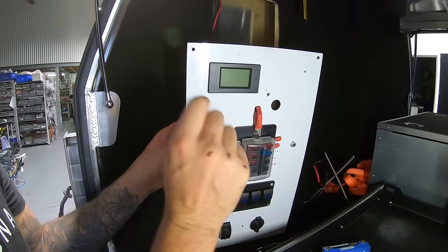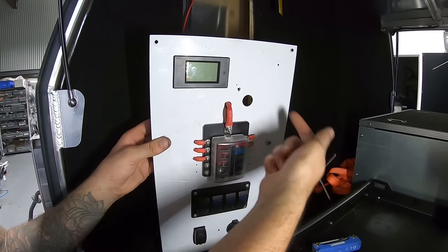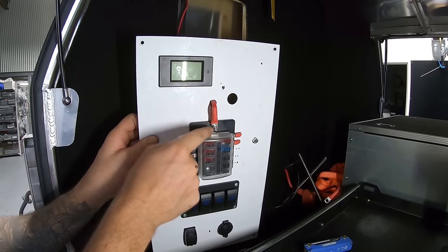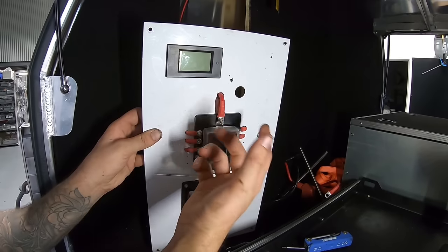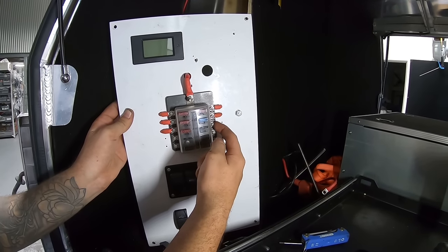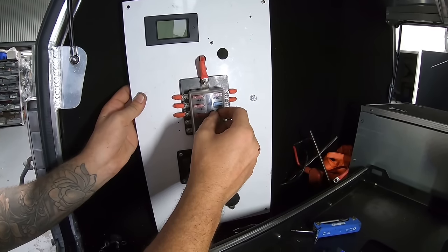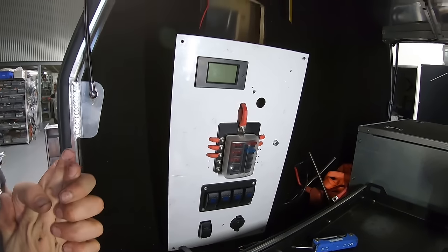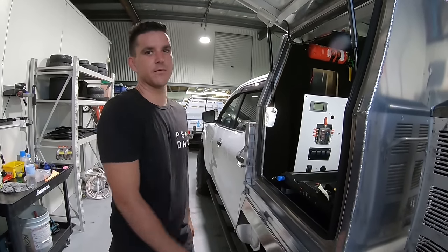How I had it wired before: the solar output came to the positive wire going straight from the battery — the wire that sits on the positive terminal went straight to the top of the controller. So it's technically going back to the battery, but nothing there was fused. On the new setup I'm going to put the solar output onto a fuse block and put a 15-amp fuse in. That way if anything shorts out and exceeds 15 amps, it's going to pop there instead of frying the whole system or catching on fire. Maybe the solar panel blew off for a reason so I could fix this and prevent a fire in the cabin.